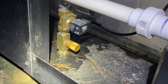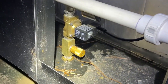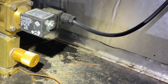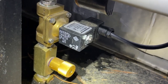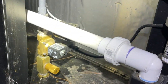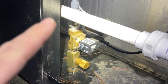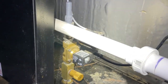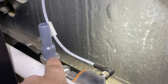You don't have to sit there and run your pump dry for a couple of minutes. Just turn it on, let it start to spin up, it's going to call for water and open that valve — you could probably put your hand on there. Actually, there may be some that have a way you can manually turn them on. I don't know if there's a setting on the kiln that you can tell it to turn the water on for a second, but anyway, do something to open that valve and let that water fall back so it's not sitting there on top. Or if you have a way to blow it out with air, you could disconnect and thread that fitting out right here and just jet air in there and blow it out.